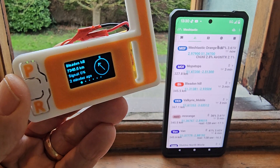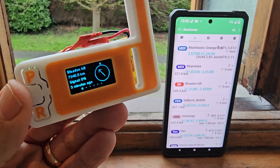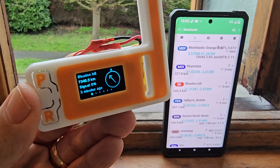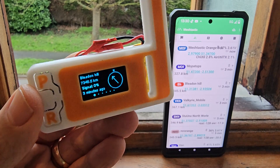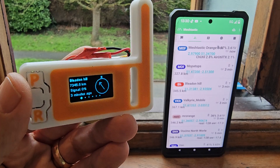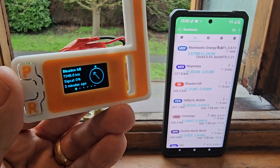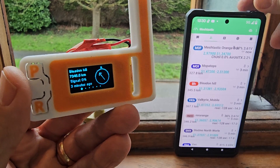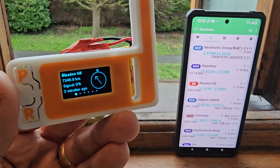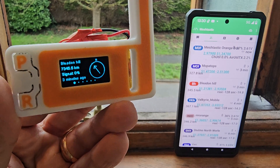You can download the Meshtastic app, you can go on the Meshtastic website to flash this device. There's a Meshtastic flashing tool — it takes two minutes to flash, there's nothing hard about it. You plug a USB in, click flash, and the people from Meshtastic have done all the hard work. It's absolutely fantastic and inexpensive. There's lots of different devices. This is the Heltec version 3. If you want super duper ones that look like BlackBerry phones, they're out there.